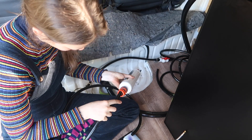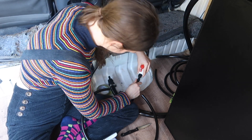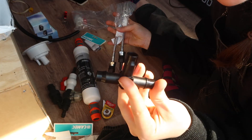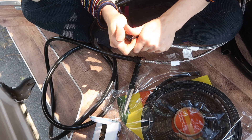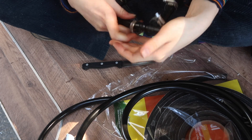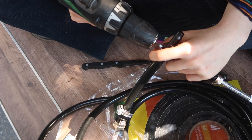Then that goes into an inline filter. It was a pretty expensive filter for me, but I thought it was important since I'm getting water from all sorts of places. I'll admit I probably got the wrong filter, but I do have the option to take it out if it's not right. From the water filter I then go into the tap. Before the tap I have a T-connection, because I don't want to install a hot water system — I'm blocking off the hot water pipe from the tap to avoid leaks and stagnant water, which is why the T-connection is necessary.